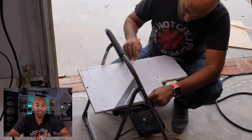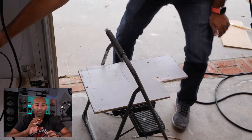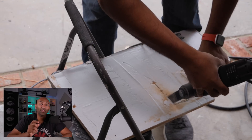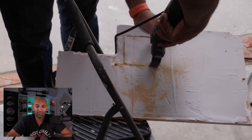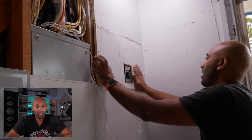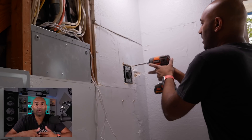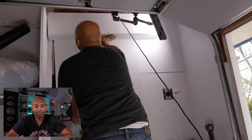Next, take the piece of drywall you're replacing and mark where the new outlet will sit, then cut out the hole. I use a specialized cutting tool for straight lines — I'll put a link in the description. I cut that out and put the panel back up. I actually used wood instead of drywall since I may need future access. Then I put the screws back on and replaced the main panel cover.